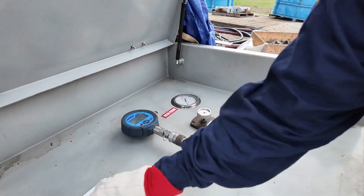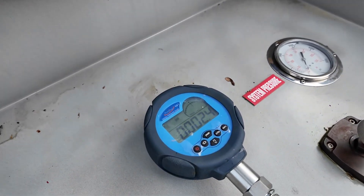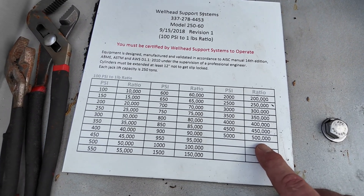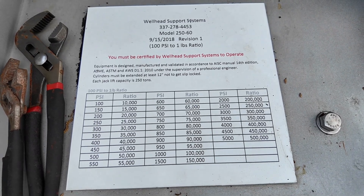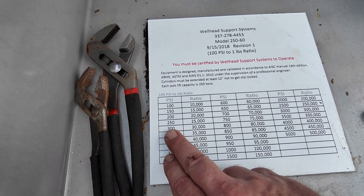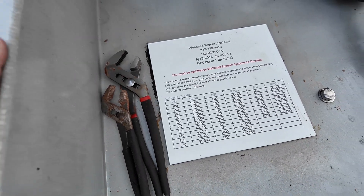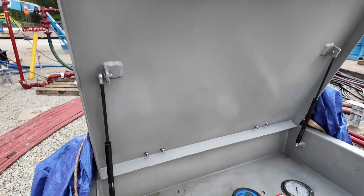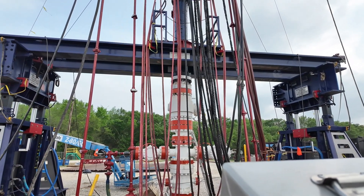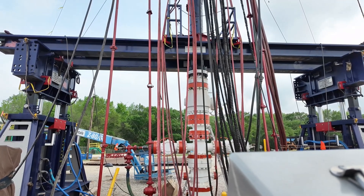When we fire that up, this is our pressure gauge that we go off of. Each jack has a capability of up to 5,000 pounds of pressure and can do 500,000 pounds. Since we knew our equipment weighed 40,000 and we want that first initial uplift of 20,000, we had 30,000 times two — that gives us 60,000 pounds. Right now, I believe everything up there is close to 150, maybe 160,000 pounds sitting on that beam.